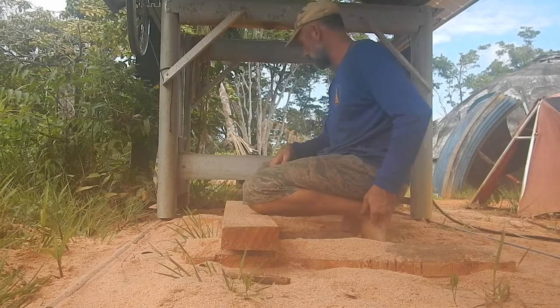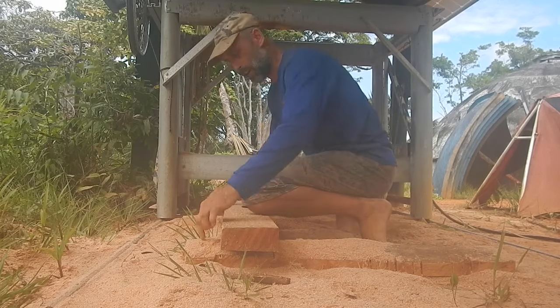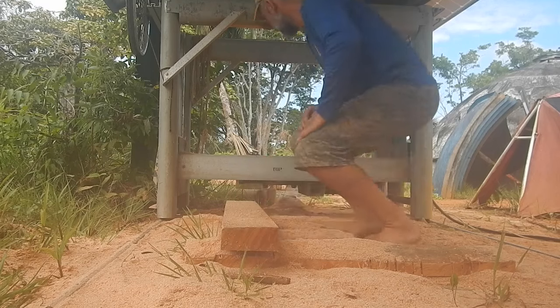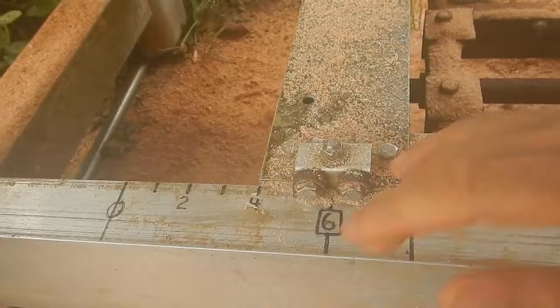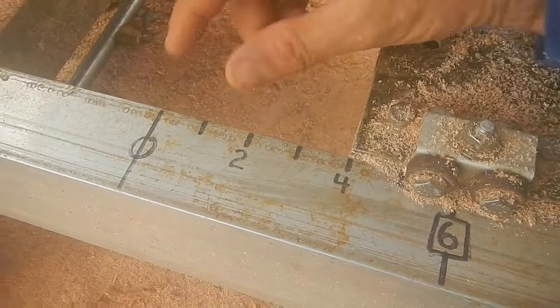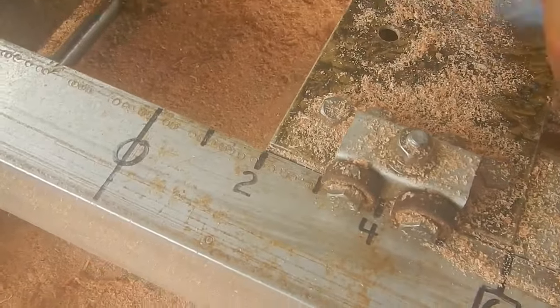All right, so whenever I want to set up a cut here, I can see where the previous cuts are on the boards below. So if I've got a flat edge on a board, I can just line it up right there and I don't have to cut that part. And over here, I've got a bunch of numbers. And I happen to be using imperial noodle units, otherwise known as inches at the moment. And I'm cutting 2-inch boards. So let's set it to 2.